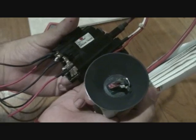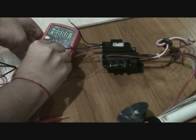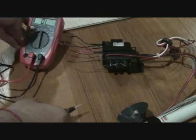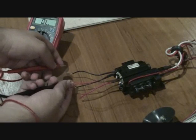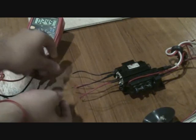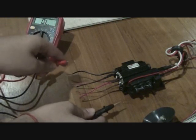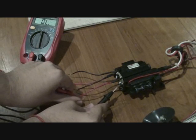To find which pins go to what, you take your multimeter and switch it to short circuit mode, which will beep when there's a short circuit. Coils are just coils of wire so they will indeed short circuit, as you can see. These are the feedback coils — they short circuit as well. The feedback has three outlets, so you've got one more pin down here, and you can tell it short circuits to this one too.